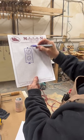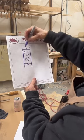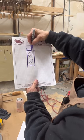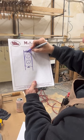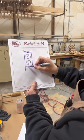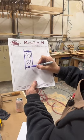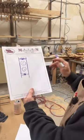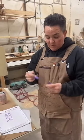The sides, you can cut right on the sides. But you want to cut out for your outlet box right to where your screw can still hook on, because they have these little feet that look like this, right? And then the screw. So as long as the little foot on the bottom of the outlet has something to rest on, which is whatever you're cutting it out for, you just keep it tight. I don't know if that's a good explanation for you, but without an outlet here to use, that's about the best explanation I can give you.